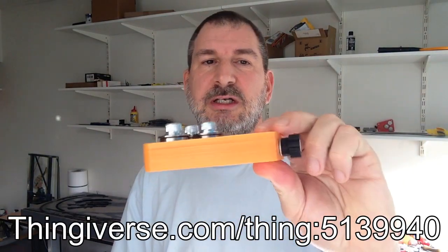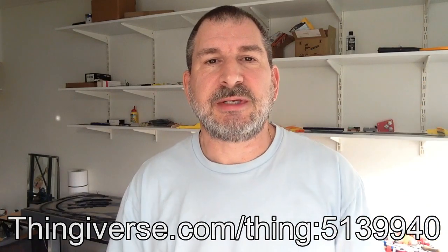With the rail roller it was a pretty simple task. You can download the STLs from Thingiverse and print it yourself. There's a list of hardware — it takes some M8, M6, and M3 sized bolts and three M8 bearings. The hardware list is included. Assembly is relatively straightforward, but I'll include a quick video explaining how to put it together as well. You do need bent nose and straight needle nose pliers to get two of the nuts to lock against each other, but it's something you only have to do once so it's not that big of a deal.